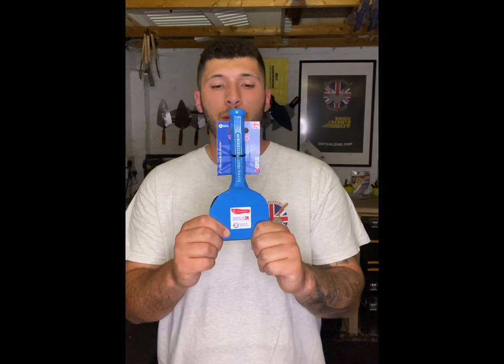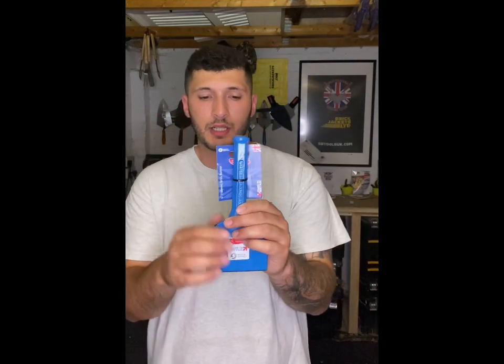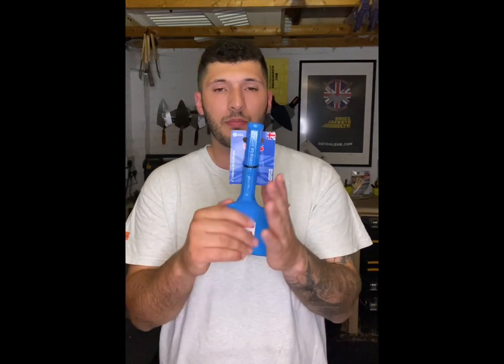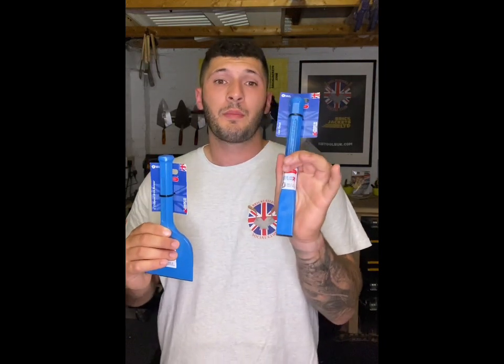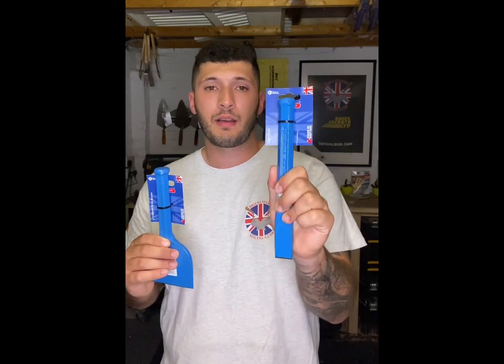A 4-inch bolster by Footprint. The reason for 4-inch is that typically a brick is 4 inches wide — 100mm or 102.5mm — and it's a good robust bolster, absolutely fine for blocks. You don't want the smaller ones unless you're doing detailed chiseling work. A 4-inch bolster is more than sufficient as an apprentice. You probably don't even need the cold chisel, but it's going in there in case you need to take out any brickwork that's a bit shoddy.